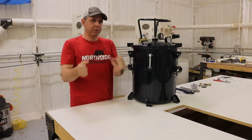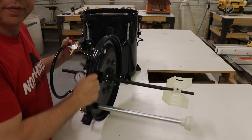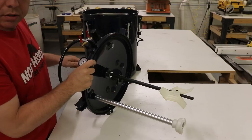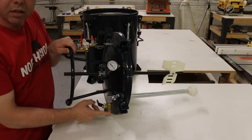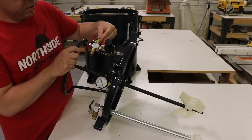I've already taken this out of the box but haven't done anything to it, so we're going to open this up. I'm going to show you how it's supposed to work originally and what we're going to do to change it. First we'll take the lid off. The first thing you'll notice is we have a pipe here and then a rod here with a little fan thing on it — this is a paint agitator. There's a handle that goes all the way through and spins to mix your paint. And this right here is a siphon tube for paint to go out of this valve to a spray gun.